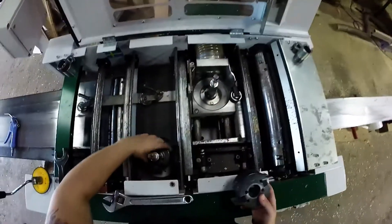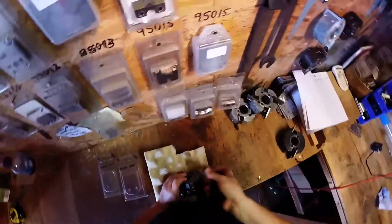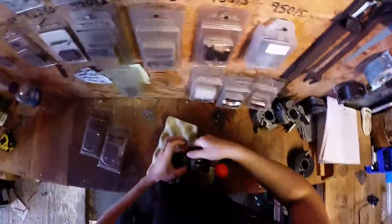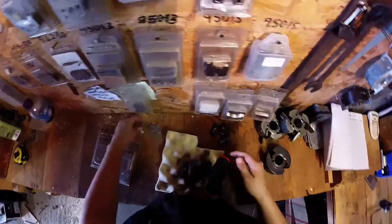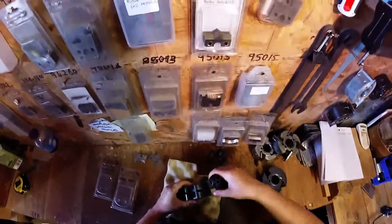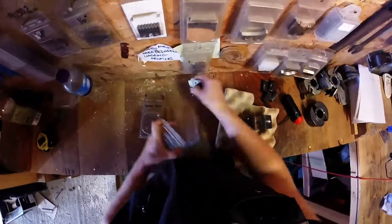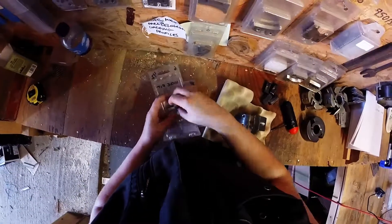The PH-260 is an amazing little machine, sold by Logosol. If you want to know more about current prices and different options, I have linked the pages in the description. We are using a 3-phase adjustable speed model. Unlike many traditional cantilevered planers, the PH-260 and its upgrade the 360 both have bottom and top cutter heads suspended at either end, which contributes to machine stability so planing full width is no big deal. This planer is essentially a combination of a surfacer, planer, and two spindle molders, and it works really well together.